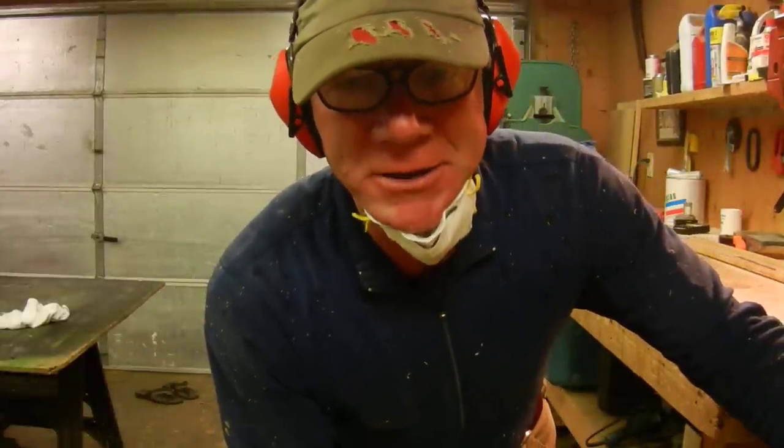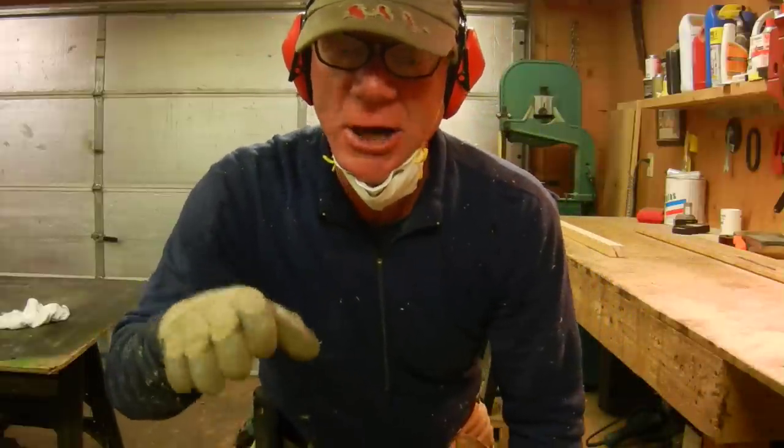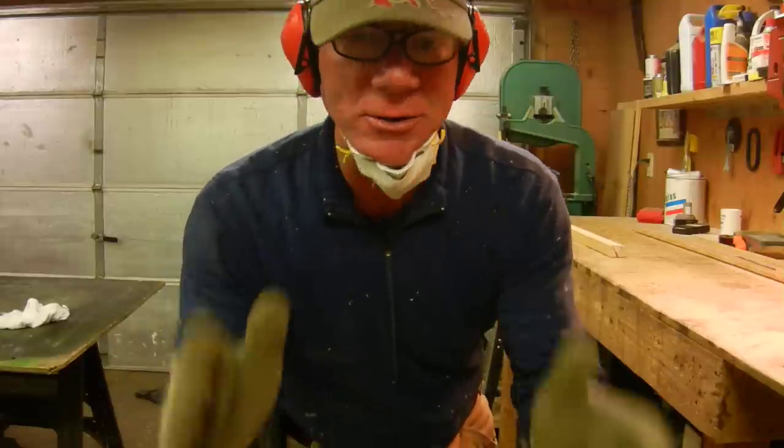That's how it's done. Sometimes I use a push stick, other times I don't, because sometimes a push stick doesn't give you enough downward pressure on the board and the saw blade will chatter and it just doesn't work as effectively. Just make sure whenever your hands are in front of the blade that you're very careful. This is not something I recommend to a beginner — I don't even recommend it to anybody. This is how I do stuff; I'm not teaching you something you should necessarily do. So just be aware of that, and that's how I make a straight edge on a board. Thanks for watching.